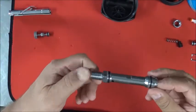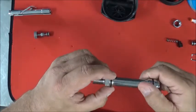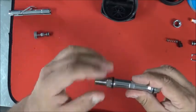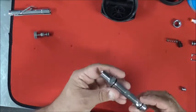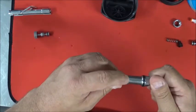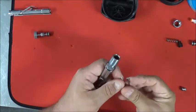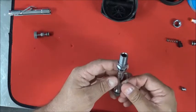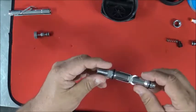Take the air barrel — cleaned out with the two O-rings on the side. When lubricating, apply just enough to make the O-rings wet, not excess. Put back the demand lever, making sure it goes on the flat side, which faces toward the diver's mouth. Try to keep the lever as close to its original shape as when you took it off — don't spread it open.